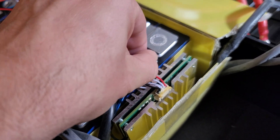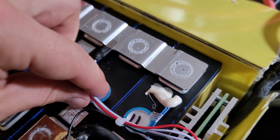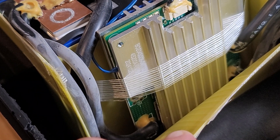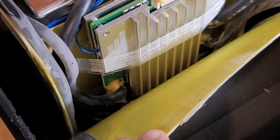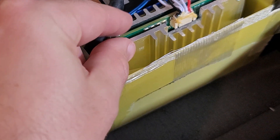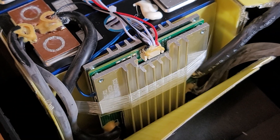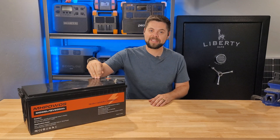Something I didn't like is that there is only one temperature sensor, and it's only on the battery closest to the BMS. I also couldn't really get access to the BMS without completely destroying everything inside. The BMS is directly adjacent to the batteries, which means if the batteries get warm, that BMS is going to heat up pretty quickly. I wouldn't put any heavy loads on this for an extended period of time — that's going to make the cells get pretty warm and probably trigger that heat sensor.